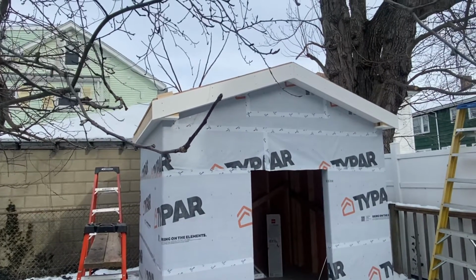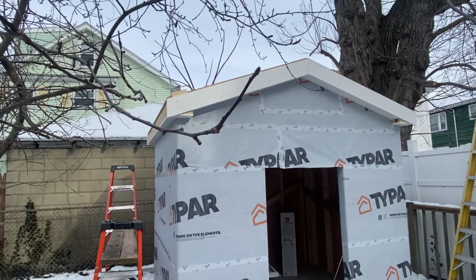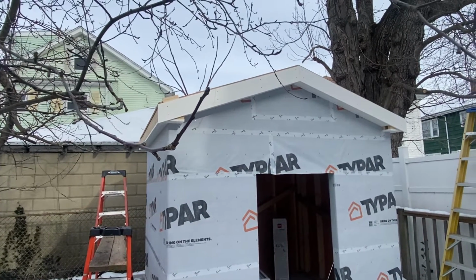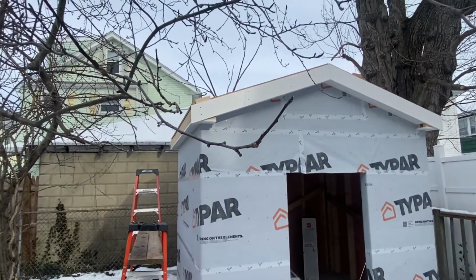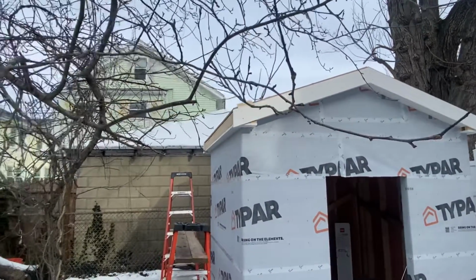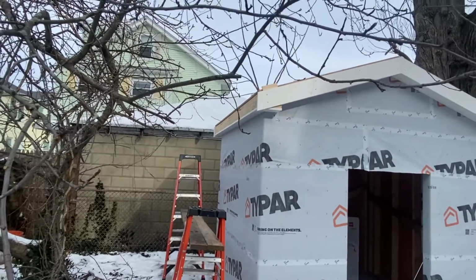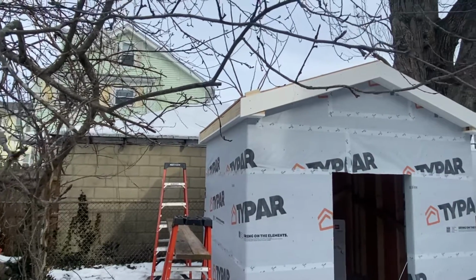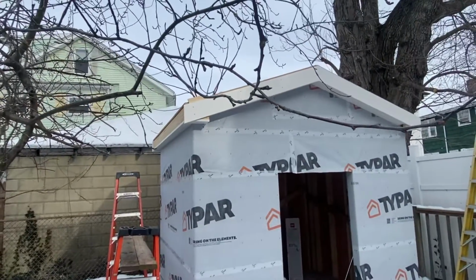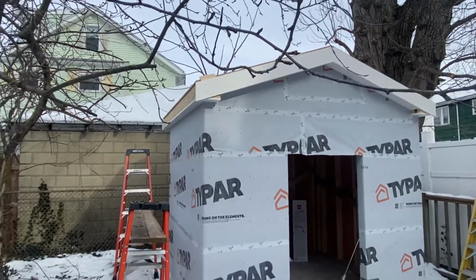I might put a small piece, maybe 1 or 1.5 inch of trim up near the top of that to act like a little bump out for the drip edge. Honestly, I don't think it matters, and really I'm just down to the trim boards on the fascia. In all cases, there's a little reveal or an overlap, if you like, of about 5/16 of an inch.